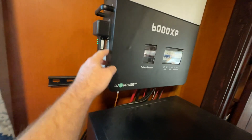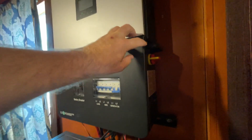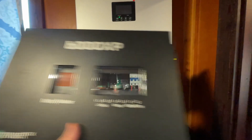Now, what we're going to want to do is, on the side here, you're going to see several screw slots. There's one here and you've got another one here. Likewise, on this side, one at the top, one at the bottom. Go ahead and remove those screws. Once you do that, we're going to be able to remove the panel — it just slips out and down.